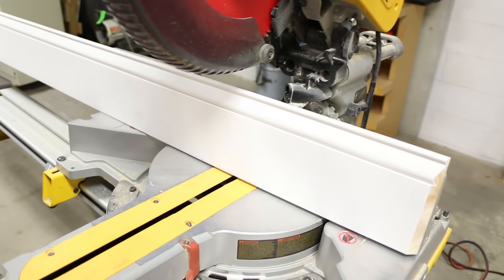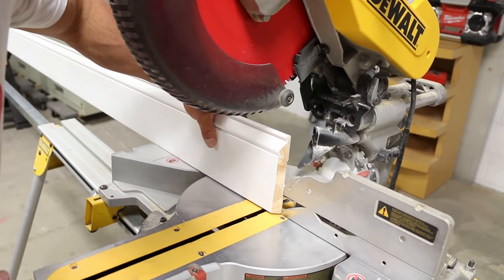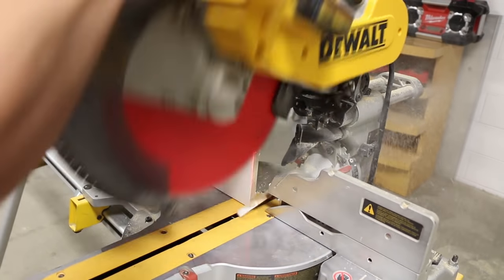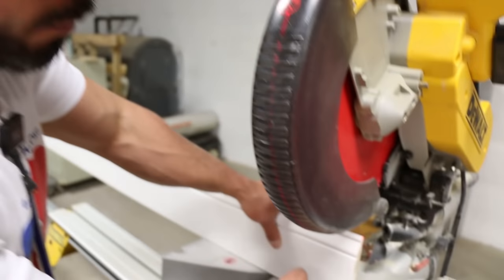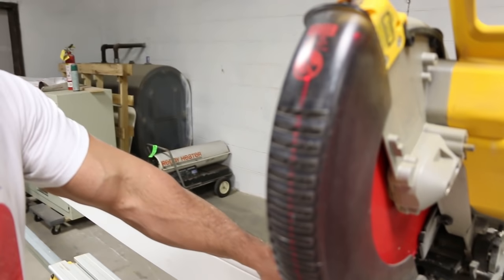We already have a piece cut here, but we're gonna show it over. So what we're gonna do is we're gonna straighten out this cut. It's a fresh piece of molding we got off the truck. We're going to assume in this example that we have a 90-degree inside corner. We're going to want to reveal the profile of the molding at 45 degrees. 45 degrees and 45 degrees — the two pieces of molding — 45 plus 45 equals 90 degrees. Nick, you understand? I do. That makes perfect sense because it's math. Then if you understand, I know the people out there understand.